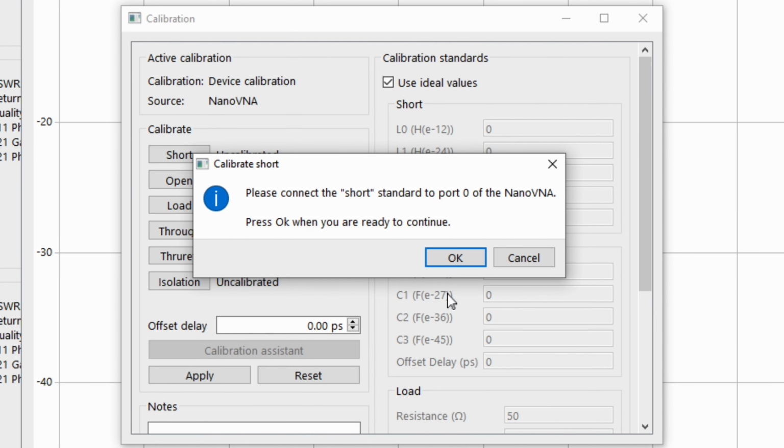But my understanding is that this line that we see here is the output, and this line is what we're receiving back. What we're seeing is, at a minimum, at the beginning, 30 dB of rejection, and as the sweep keeps going, we get down to near negative 40 dB on 80 meters, at least 35 on 160 meters. If we progress, we see that all the bands have rejection of at the very least 30 dB until you get to 10 meters, where you're looking at 20, call it 25 or so dB. Actually, if we go here, we should be able to see what the rejection is. There we go, negative 26 dB of rejection at the top of the 10 meter band for this choke.